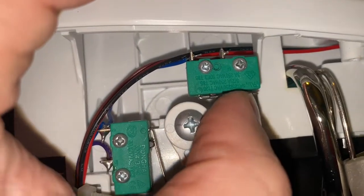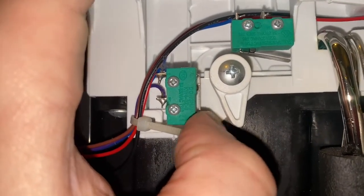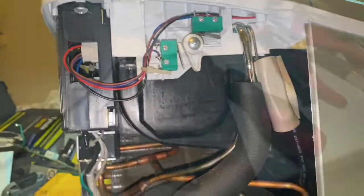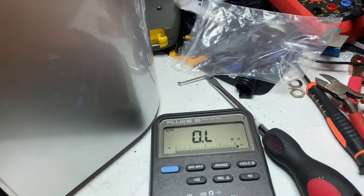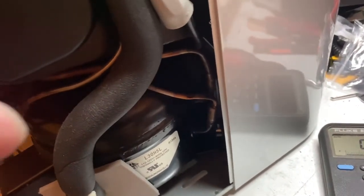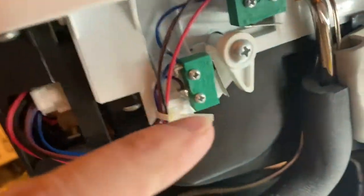Here are some switches. Let's see if you can hear this one — it doesn't click. Let me get the ohmmeter out. With the ohmmeter you put a meter lead here and here. You should have infinite resistance open, and then short when closed. The meter on the first switch is reading 17 ohms — it should be open. With the switch closed it's reading zero ohms. On the other switch: open it's showing 10k, and closed it's doing 20 ohms. That tells me that switch is bad.